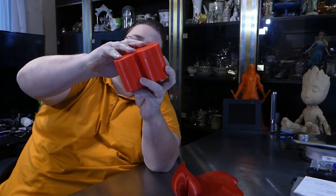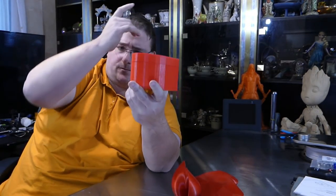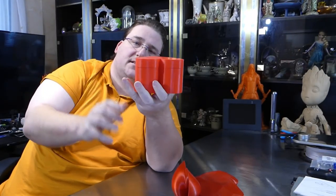It's a long print, a lot of plastic, very thick — about 180 grams. It doesn't lock in there, so it does pull off pretty easily with a little tug. But it works — I'm pleased, that's nice. I printed a whole bunch of these all at once on the N812. I just filled the print bed with a whole bunch of stuff and hit go. I had to help the first layer a little bit, but beyond that it worked nicely. It was UltraBase, so when it cooled off, I just took my arm and swept, and all the parts just came off the bed.